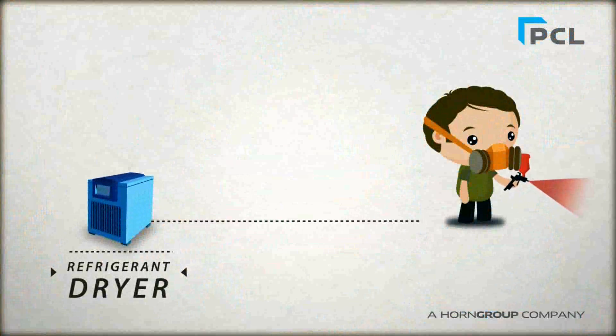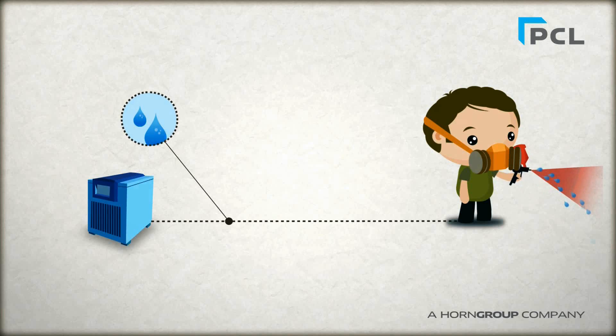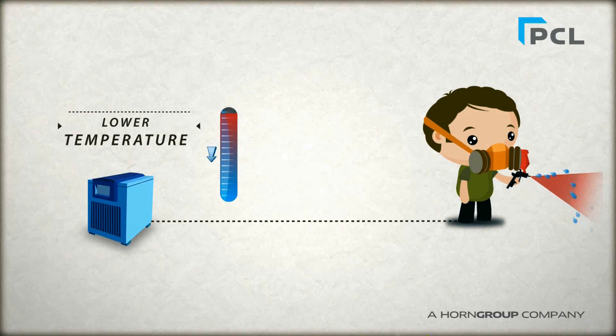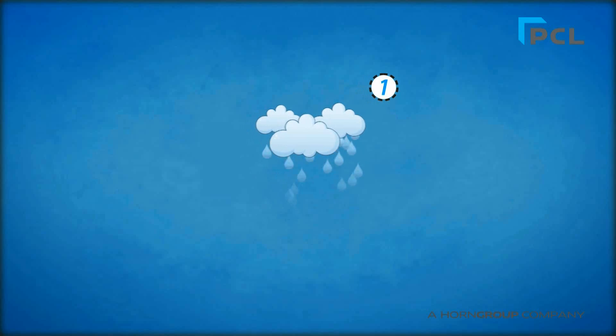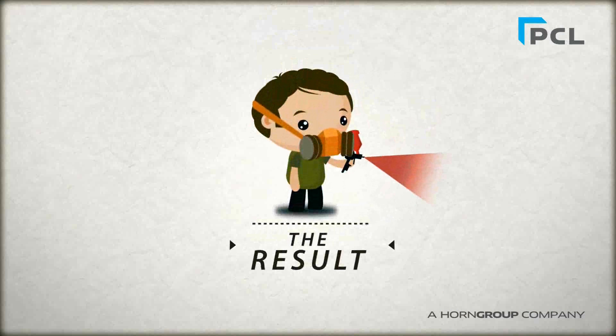In the pipeline, there is a strong likelihood that water droplets present in the compressed air reach their saturation limit whilst under pressure, then condense into water and contaminate the dry air, especially when ambient temperatures are lower than the temperature of the compressed air. This saturation limit is reached sooner on wet or colder days or during the winter months. The result? Water contamination at point of use in the spray gun or air tools.